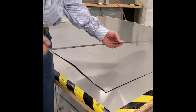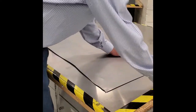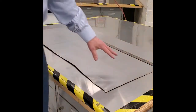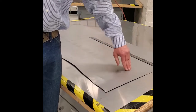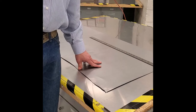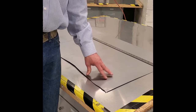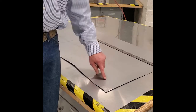Second rule: always measure twice, cut once. I'm going to put this back on there and double-check to make sure it's accurate. Probably a good idea on this one to check a couple of different spots and make sure it's four inches. This is the most important cut of the whole piece. If this line is crooked even a little bit, it's going to make it kind of tricky to put this together — not impossible. Don't throw away metal if you think you messed it up; I can show you how to fix it and we can salvage it. We've got a line marked; we're going to head over to the squaring shears and cut that piece off.